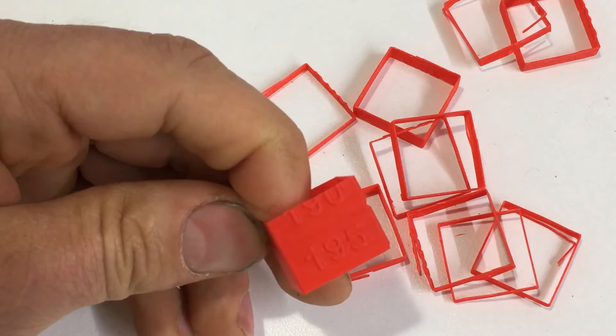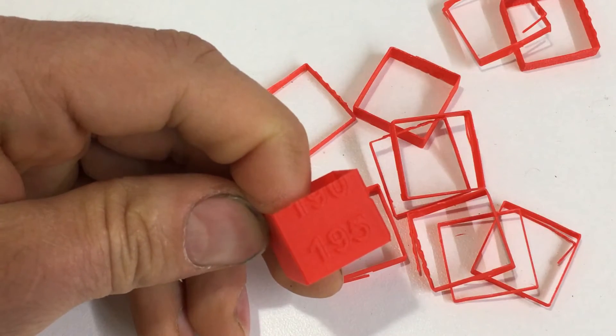Because it's cooler, it also prints out a lot smoother, so with this material and this color, 190 is the temperature I'm going to be printing at. That's how I've been using the temp tower — it's not just about how it looks, but also how strong it is and how much adhesion you get between the layers. When I started out I thought for sure the hotter I got the more it would bind, and I was actually quite shocked to find out how easily the temperatures that were too hot came apart.